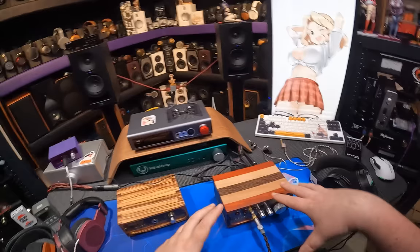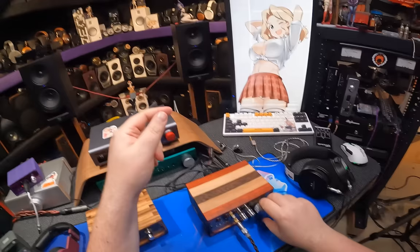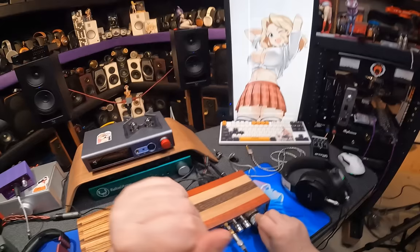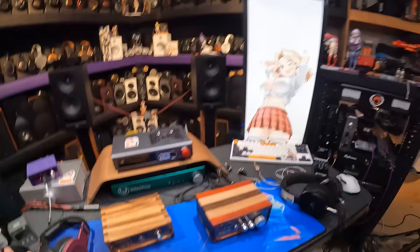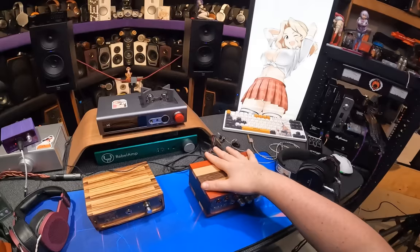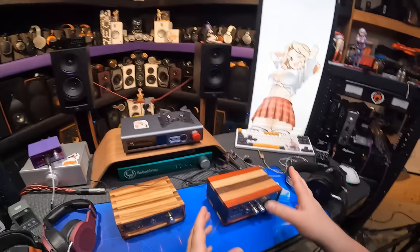The issue is there's no switch to disable the output, so I'm using a Kilowatt Edge to cut power to the studio monitors. Also worth noting: things like high/low gain and tone controls pass through the pre-out, so I've actually got a bass boost on those monitors right now on the low gain setting. This unit has been on my desk for months — it's actually a hand-soldered unit from before they got the machining set up.